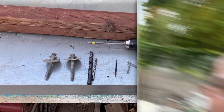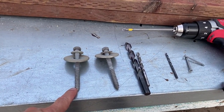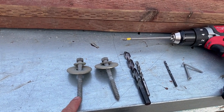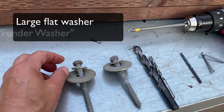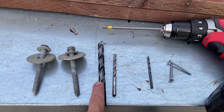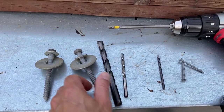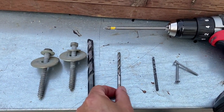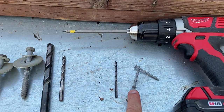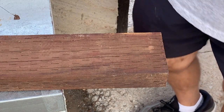These are about half inch or three-eighths inch by three inches long - these are called lag bolts. I've got a big flat washer and a small washer, two of those because those are the hinges at the top. I've got a big drill bit just bigger than the lag bolt for making the hinge, a pilot bit for that, and a smaller screw for when I put the drywall screws in for the one by threes - I'm going to drill the smaller hole first.